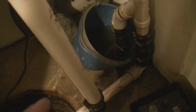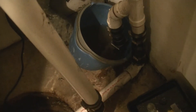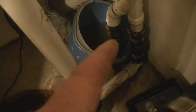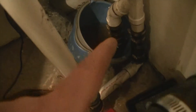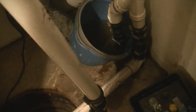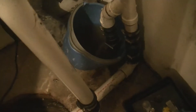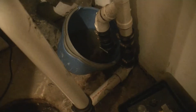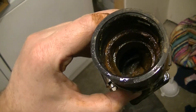Here's something I found now that I have the backup battery pump out — it was wasting a lot of electricity. The check valve here was leaking by, so it was letting the water come up and go right back down into the pit. So I have a new check valve — I'm going to be replacing all the check valves at this time anyway. But you can see how much water is in the bucket; that's all water that would have gone right back into the crock. I'm going to pop that check valve off and slip this one on and tighten it down.